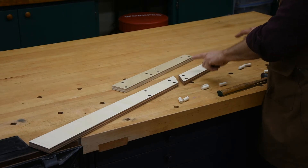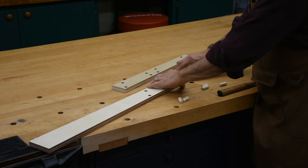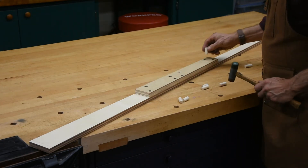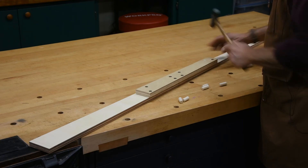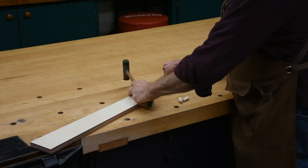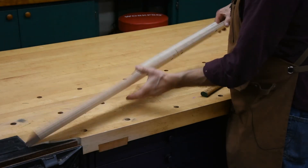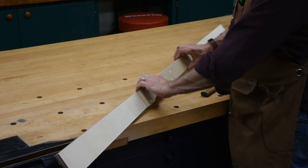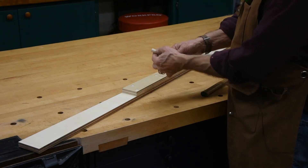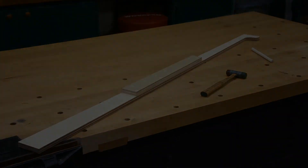This last template I need to cover is for the leg. As you can see, I've cut it down into two pieces — that's to facilitate shipping. The way you bring it back together is: line it up, and I've got what I call a bridge. Place it over the top, line up the holes, and we're going to pound in a series of half-inch dowels. It should come out very flush. In the kit that I send out, you'll get a blank dowel and you'll have to cut them down to size to fit in and do that.